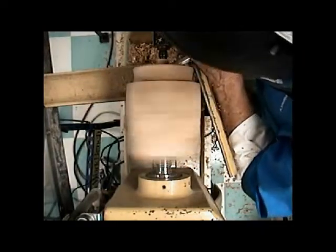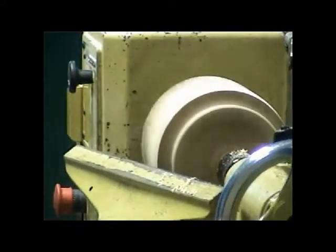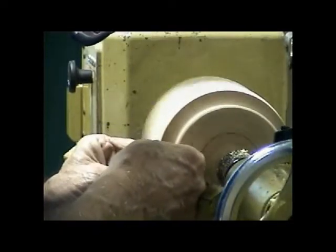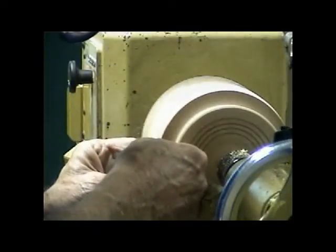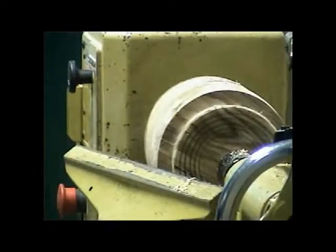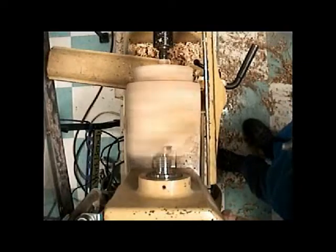I need to take just a tiny bit more wood off. When the faceplate sits on there it's going to sit tight against the rim — it won't rock. If the faceplate rocks it'll pull the screws out. If you can turn dead flat that'll work, but the faceplate will tend to slide around a little bit. I'm now marking with the pencil circles on there. One of those circles will be close to the outside rim of my faceplate to help me center it up when I put it on.